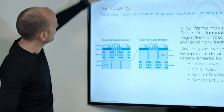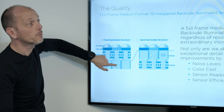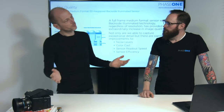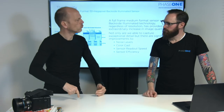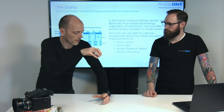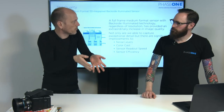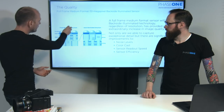The problem is that light coming in from the lens will pass through the color filter and then has to pass through this layer of electronics before hitting the pixel itself. With very large pixels this is not a problem, but as pixels get smaller and smaller, a certain amount of electronics has to be there for each pixel, taking up a relatively larger area. So there's less efficiency of light hitting the actual pixel — the compromise between electronics and transparency becomes more difficult. One problem is that the light essentially hits the electronics and is scattered.